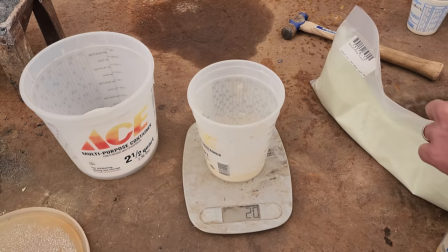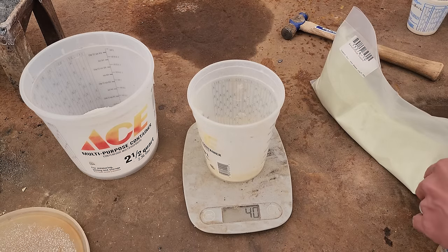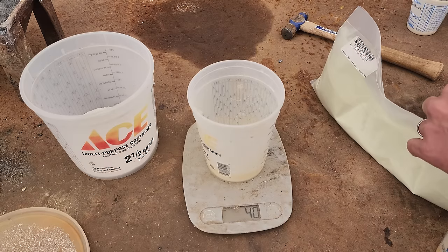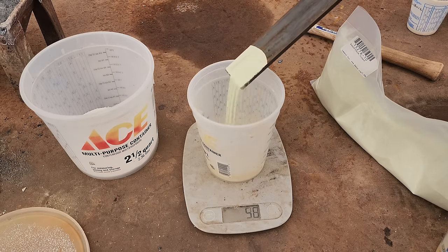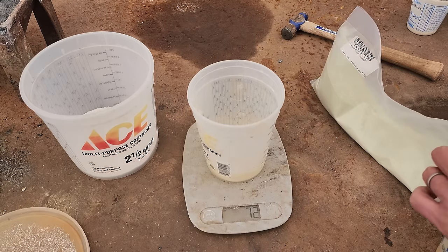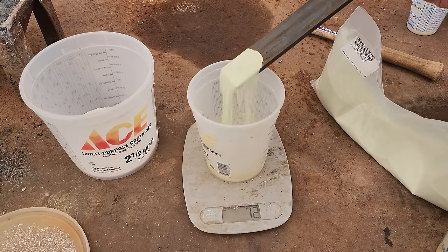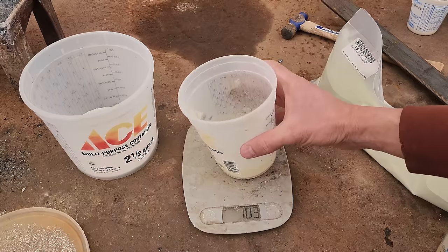So you get iron oxide and that helps reduce the amount of sulfides you have in your ore, reducing the likelihood of getting a matte, as well as getting your collector metal really, really fine, really, really disseminated throughout the charge. And it really helps collect all that super fine gold and silver we're trying to collect at the bottom. Now, I wasn't paying attention.